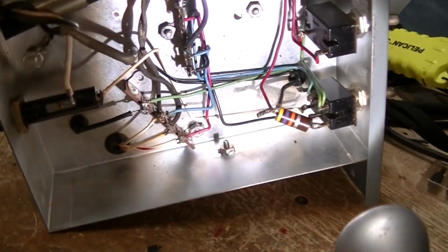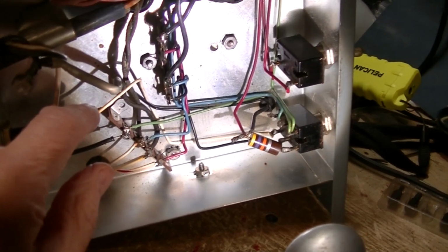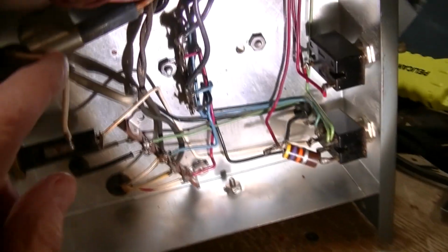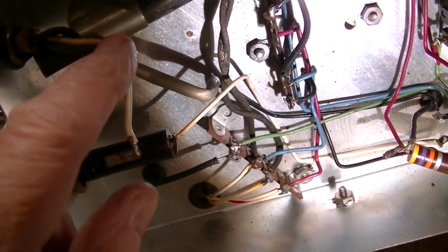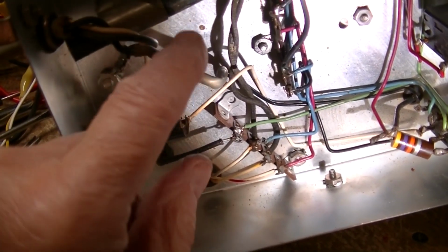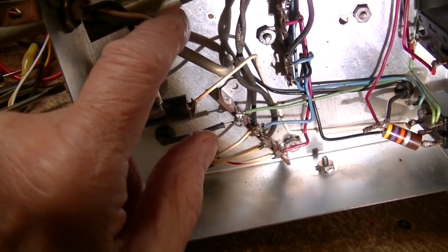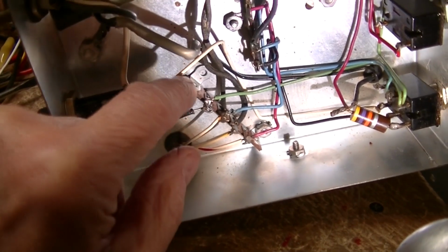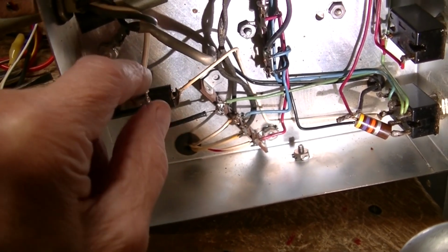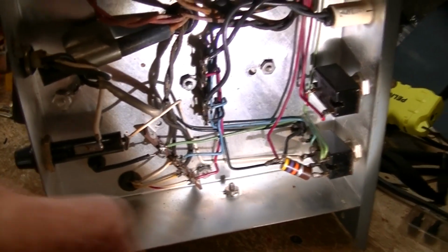And I traced these wires out, and it appears that the neutral and the hot are switched, which is good. But I think what they did here is this was probably fused. This probably went down here, and they put a piece of heat shrink on. That can't be factory. Somebody must have changed it. But why would they not fuse the hot and fuse only the neutral? Normally these should be unsoldered, put some heat shrink in there and butted together, and that should go straight through. And the hot side should be fused. But I've got more tracing out to do here.